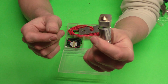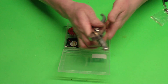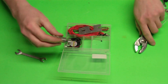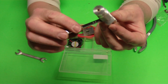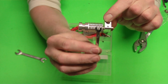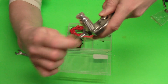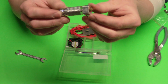Basically what you're going to do — it's going to come for the most part pre-assembled. The first thing we want to do when we get it out is make sure that the brass nozzle is nice and tight on there. Get some tools and make sure that it's tight. The Hexagon will come with a small wrench and that is going to hook right in between the heater portion and the cooling fins. We're going to use it to tighten this and make sure that it's tight. If that's not tight and the nozzle's not tight, your hot end will jam and it's not a very fun thing.